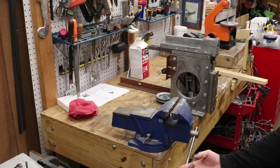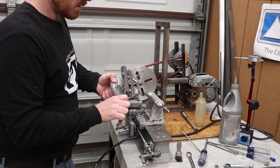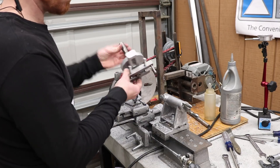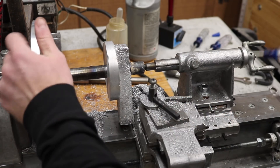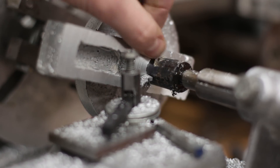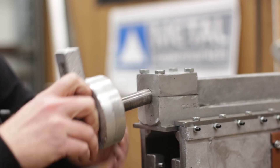Looks like it might have worked! After I cut off the sprue and runner, I took that arbor over, put the lathe dog on it, mounted it up between centers, and got started facing it off. There's plenty of space to work on one side of the part, but when I flip it around to face off the front side as it will mount on the shaper, there's really not a lot of room. The tailstock is extended about as far out as it can go. These indexable high-speed steel insert tools really facilitated this cut — I'll leave a link in the description. They're handy for tight spaces and take out some of the variability associated with grinding your own high-speed tooling.